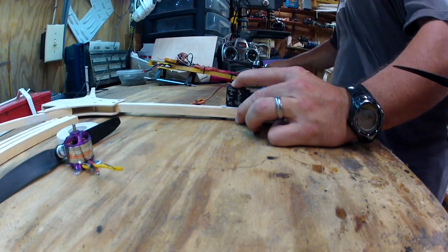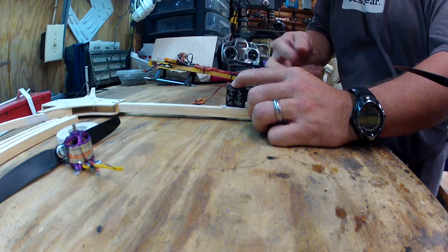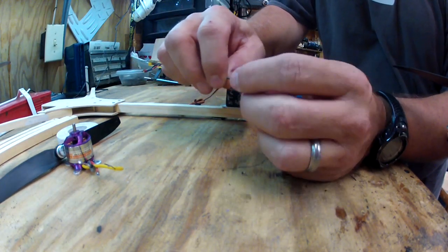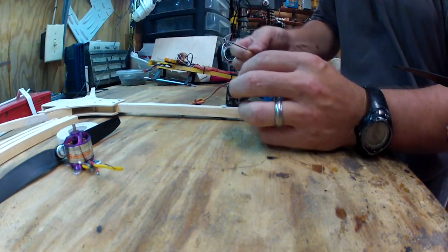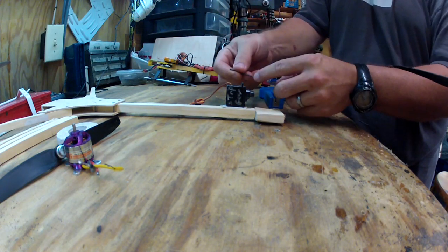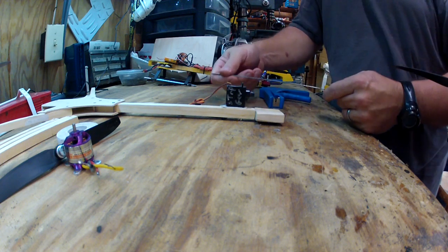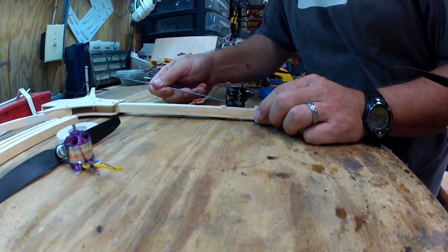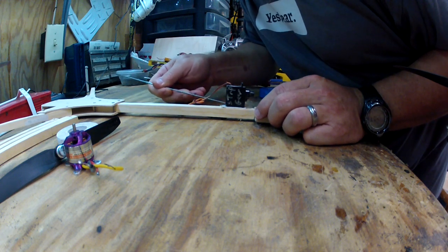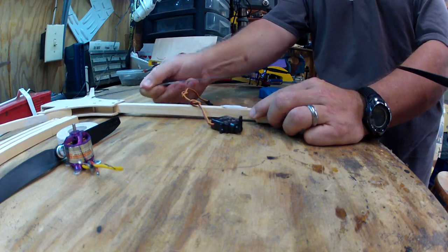You can take your control rod and basically you want to bend it. Usually I put a collet — or the actual connector — on here, and then if I have this off the table I'd measure down until I see where I need to make my L-bend going in here. Make the bend and you just slide it right into the hole in the back. This is threaded so it's probably not going to go in, but unthreaded 256 rod will slide in nice and tight.